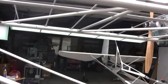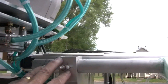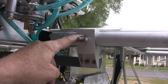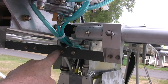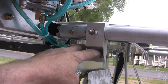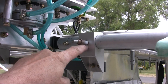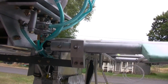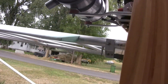I'll get a little better look here at the flap buildup. These are the brackets that will be attached to the flap spar, down to this bracket which is attached to the motor — and that's what drives the flaps up and down. Right now I just have a cleco in place, but I had to locate positions and you just do one thing one step at a time. And as you can see, it's the same for the other side as well.